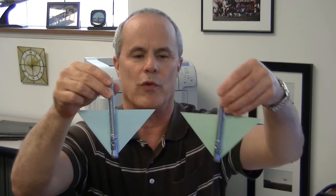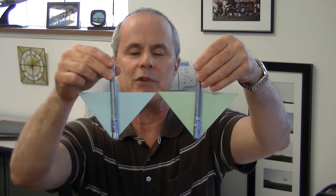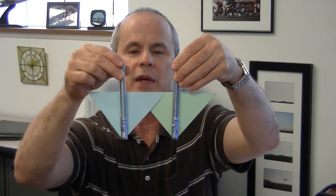Now in graphic form, the cone of concrete would look something like this, and each diameter has to be spaced from each other a distance so that the cones of concrete do not overlap. You've got to keep them far enough away so they don't overlap, because if they do overlap, it creates a situation where the holding values of both wedge anchors may be altered.